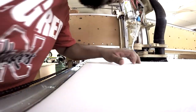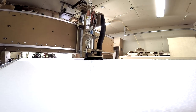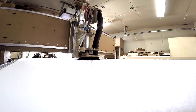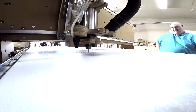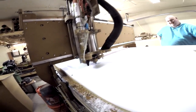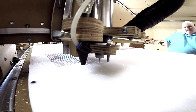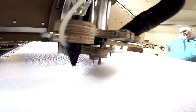And then, not only what you talked about, going from cutting and stopping and cutting, I was maybe also thinking about the results of each corner of each single block, maybe chipping or having some sort of imperfection when it comes to every single block. Right, because of the stopping and cutting. Every single corner, you also had to find the right feed rate to make sure you have a really good quality of an edge in that diagonal pattern as well. I think the testing helped us out, knowing what that should be. Yeah, and that's also essential when you're trying out a new material, obviously.